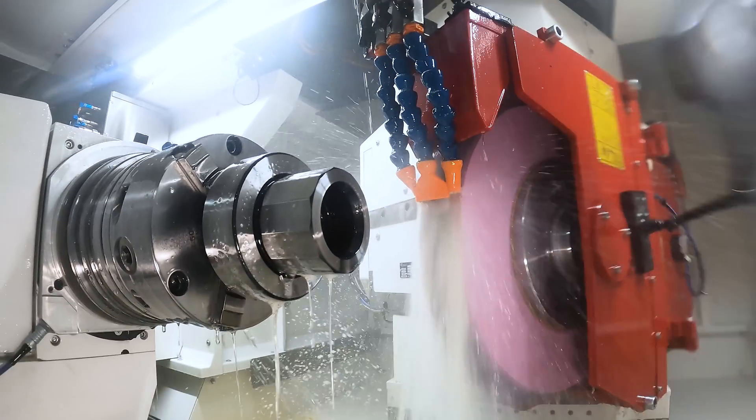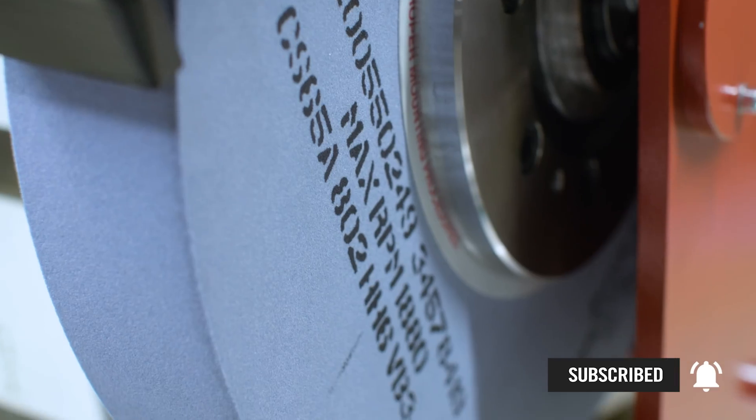We've been doing a lot of grinding with a 30 degree wheel, but today I mounted a 90 degree wheel which is known as a straight wheel, and I put a different type of dress on it so we can achieve a crosshatch.